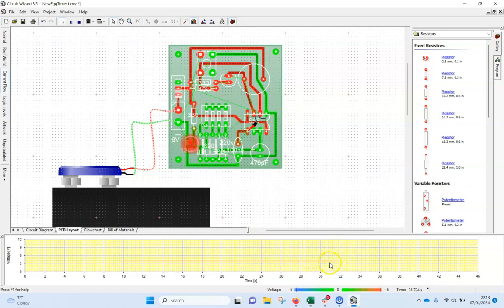Hopefully that pin is now going up, and in about two minutes it will go off and make a beep. To prove it works, you do a screenshot like that to show it working. Hopefully if you give it a minute or so that should be going up — I'm not sure there's a way of getting a numerical reading on this graph, but it should take two minutes, get to about six volts, and the buzzer should go off. So you've gotten to this point — well done. Screenshot that and put it in for the assignment.